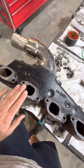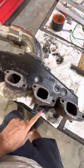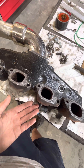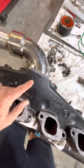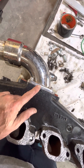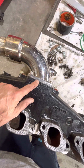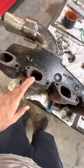The customer complains of water in the oil. So what we did is we disconnected the water hose from the water pump that feeds this. We ran it with the spark plugs in at first and we had water coming out, blowing out of the spark plug holes. We checked a few things and redid this gasket area that was warped about 30 thousandths of an inch — we thought for sure that was it, but it was not all of it. It did take care of the water in this hole by repairing this gasket flange, but we still had water on this one a little bit.